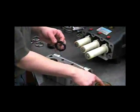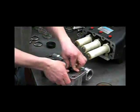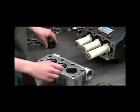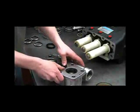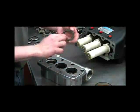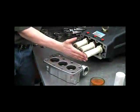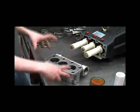Now we'll put these spacers back into the manifold. Put some oil around the outside and inside of the low pressure seals. You can start them by hand, and it may be necessary to use your PVC pipe to tap them down the rest of the way. Before we put the inlet manifold back on, you'll want to turn the pump shaft so the two outer plungers are the same length — it'll help you put the manifold back on straight.